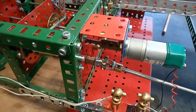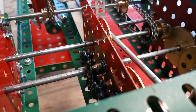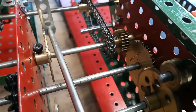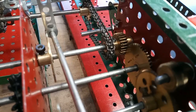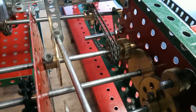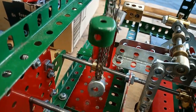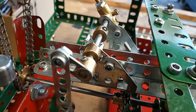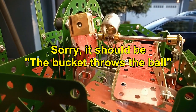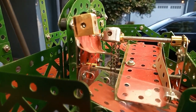There is the motor that goes through a 2-to-1 reduction gear and then through the intermittent drive, so the shaft revolves just half a revolution. Then there's a 2-to-1 pair of gears that causes the main shaft to revolve just one turn and then pause. So the buckets arrive at the end of the ramp and then wait while the gate allows one ball to drop in. At the top, the ball is thrown onto this little chute here which sends it onto the ramp, and then it just pushes the ramp out of the way as it goes down.